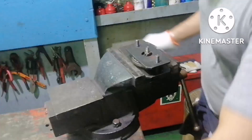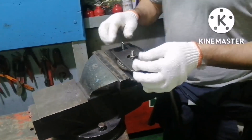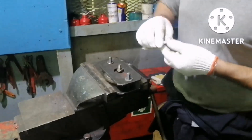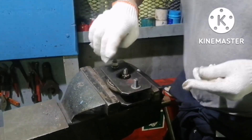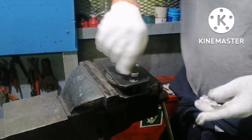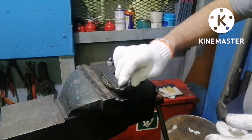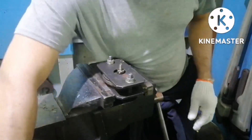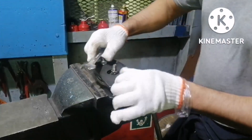This is the top plate. Both should be held together, and you can use the nut and washer and tighten it by hand, then tighten it with the spanner very slightly — you should not over-tighten it. So this is how you have to fix the valve for servicing.